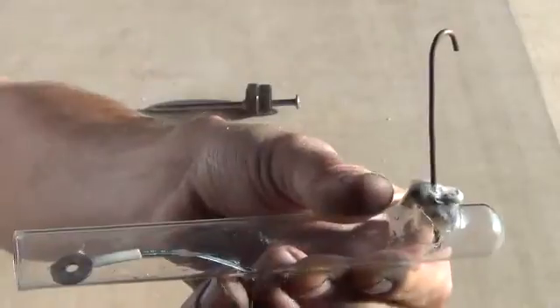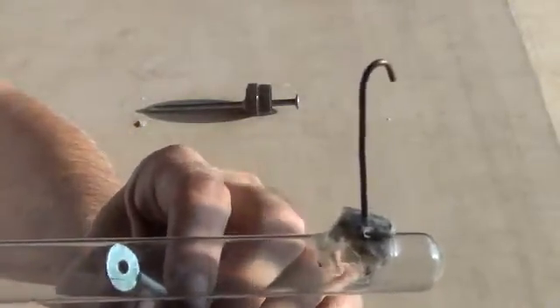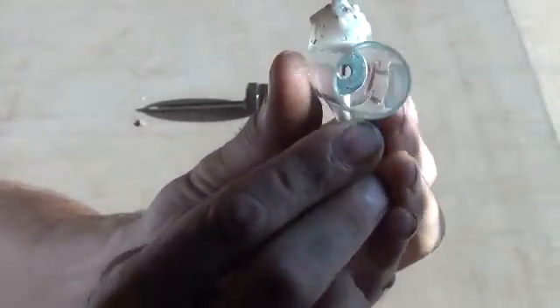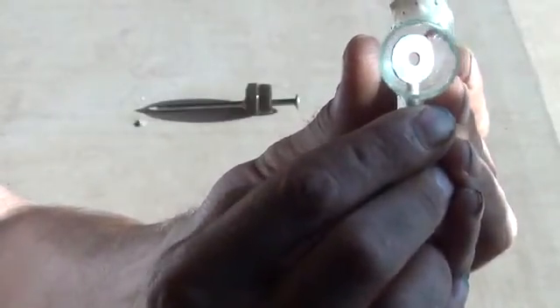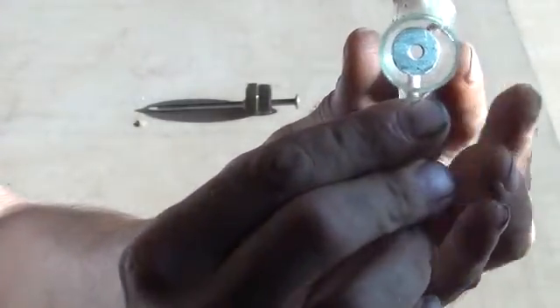I should be able to pull that out the bottom of the hole and get that ready to go. Alright, so there it is — it's set down inside of our tube here. I'm going to hard mount this with some glue in a moment. When that's perfectly centered, you'll notice it doesn't touch any of the glass inside of there — it'll have that nice insulator coming through the hole. I'm going to mount that now inside of that, and that'll be our actual cathode, producing our anode rays out of the back through that hole.